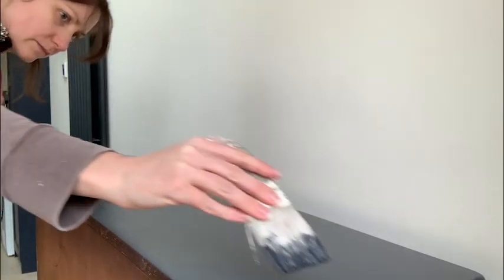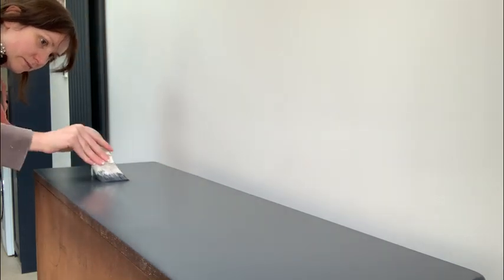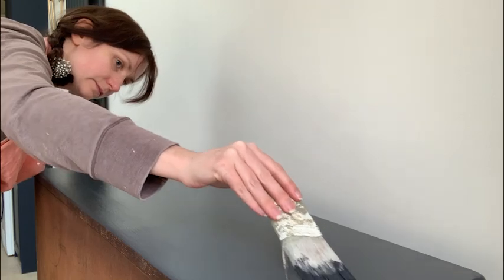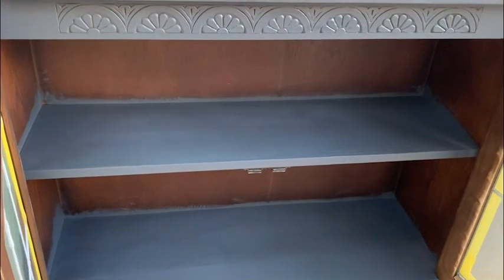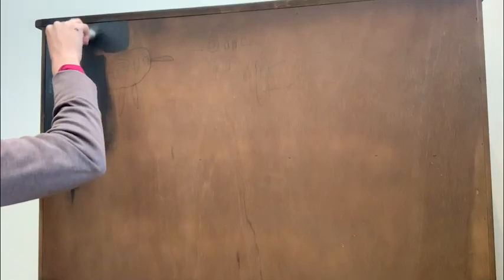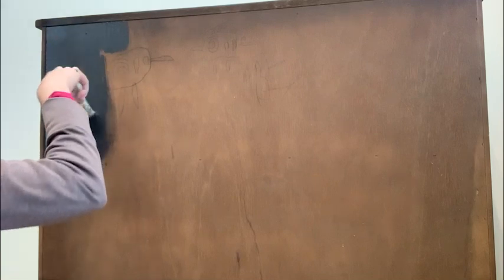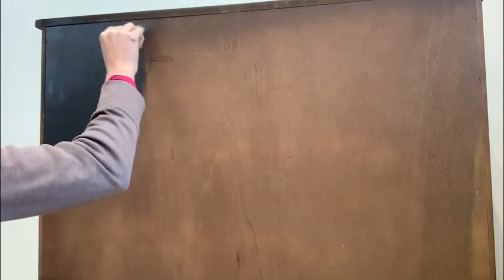Here I'm doing the laying off method, which is just removing the extra paint that isn't needed from the top so I get the best smooth surface possible. As you're likely to cause a mess if you go over paint that's half drying, I deliberately waited until the shelves were fully dry before painting the sides of the cabinet too. Sadly it was time to say goodbye to those adorable children's pictures — if the piece was for me I might have kept it because it added to its story, but I didn't think a customer would like someone else's drawings on it.